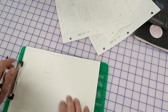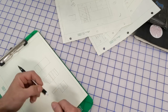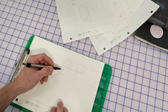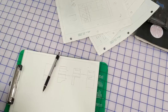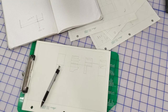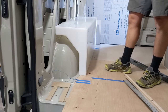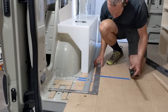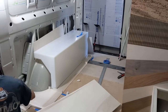What is really hard to capture up front is the design process. There's the obvious — I need a kitchen, it's going to be about this big — but when building lightweight it gets really complicated because you're always thinking about exactly how thin you can make each part, how strong it needs to be, and how to reinforce it. You've also got to factor in where to run plumbing and electrical so it's all seamless, and whether you need to reinforce parts so there's enough meat for screws for things like hinges. And then even after I get a pretty good idea of how I'm going to build this, I struggle with exactly where to start, because each wall or horizontal has a lot of impact on the other parts of the cabinet.